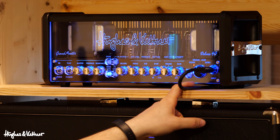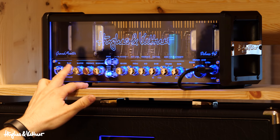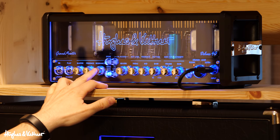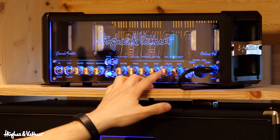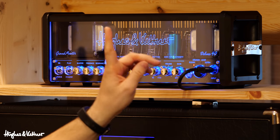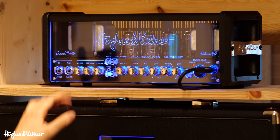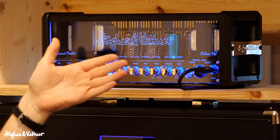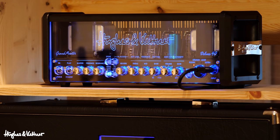When you don't have a foot switch connected, you're in stomp box mode, controlling the controls on the amp as you see them — four different channels with a setting for each. On the amp front panel we've got our master section: the master volume, which is the only knob that is not storable, plus presence and resonance controls. There's a reverb, which is also global without a foot switch, then your EQ, volume for the selected preset, and the amount of gain. There's also an effects access mode button — pressing it makes these knobs control effects parameters instead: delay level, feedback, time, modulation type — chorus, phaser, flanger, tremolo — and intensity. They're essentially multi-function knobs; you just have to enable the alternate function.